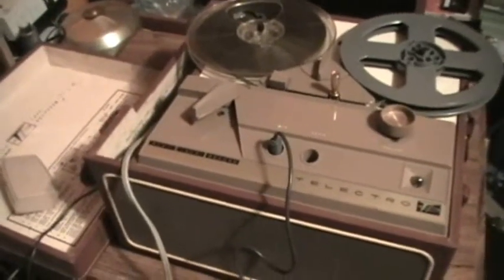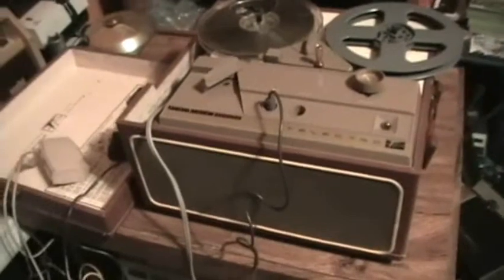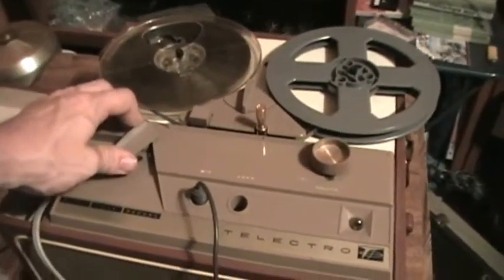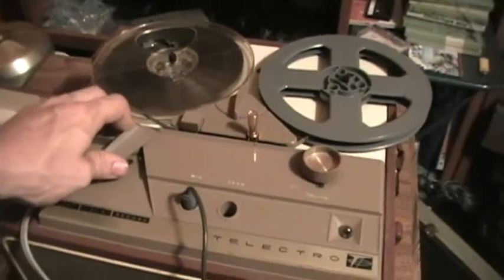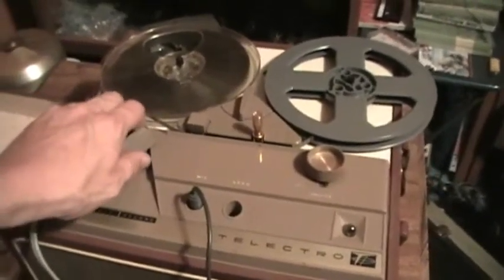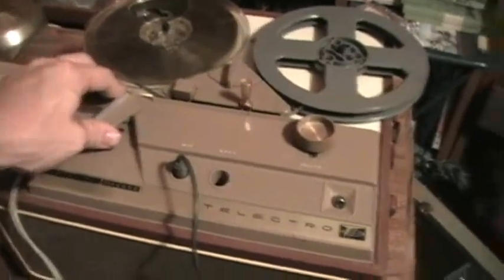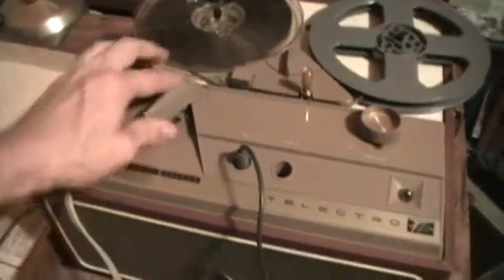Of course, because it was cheap, the computer's sound was built onto the motherboard instead of having a separate sound card. You know what that means? Instead of frying the sound card, it has to fry the entire motherboard. And I had to pay for it too. It's over $100 to pay for it. It sucked. So don't ever hook a hot chassis to a computer. And plus, from that, my parents for a long time never let me hook anything up to the computer, thinking it would destroy it. But I've learned since then, and now I hook up all kinds of things to the computer, but I don't dare hook this up to the computer.